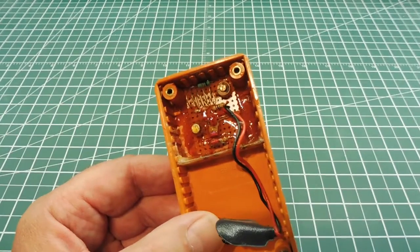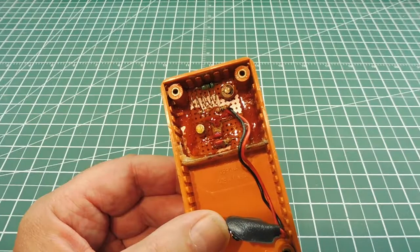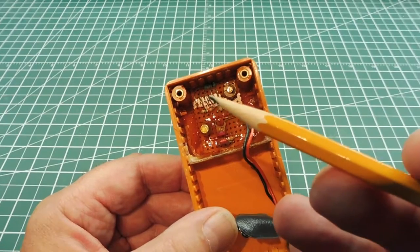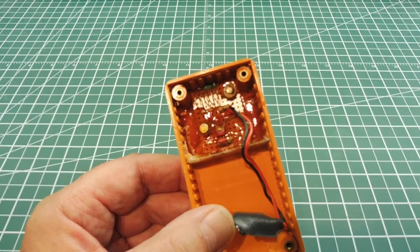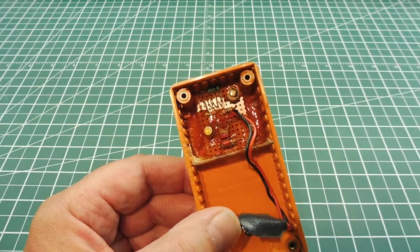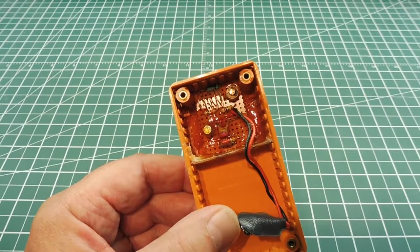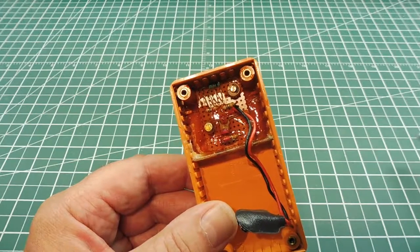Here's the inside of my little FM radio transmitter. Normally you'd have a microphone and a little preamp feeding the circuit, which would frequency modulate the oscillator and transmit signals to an FM radio receiver. But in my case, I frequency modulate the device through this little coil of wire — this coil is an inductor, and together with the trimmer capacitor it forms an LC circuit that determines the transmitter frequency. When a vibration hits the box, the coil vibrates and modulates the transmitter. You hear the vibrations through the movement of that coil, which acts like a spring.